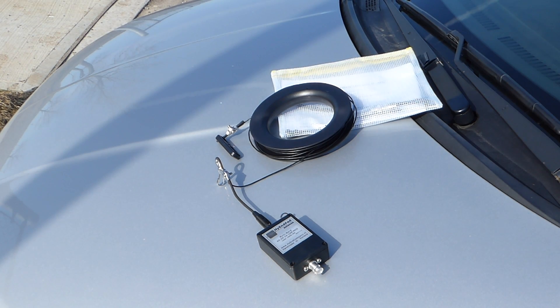The weight of the antenna with the included durable ziplock carry bag is only 315 grams, or approximately two-thirds of a pound. If you want to decrease the weight even further, you could use a lighter weight ziplock bag or forego a bag altogether and not take the included convenience wire spool. In order to minimize the antenna's weight, High End Fed made a smaller matching unit and put a silver-plated BNC female connector on the unit rather than a full-sized SO239.